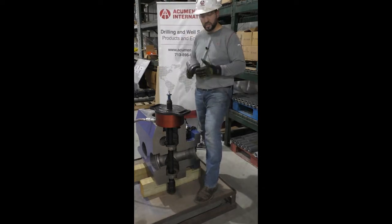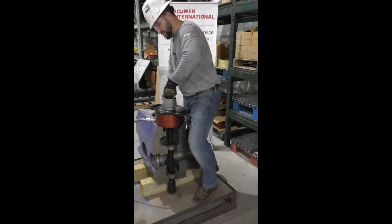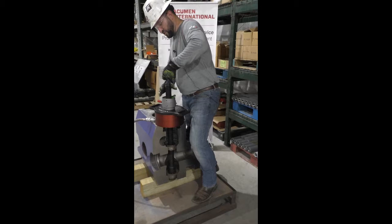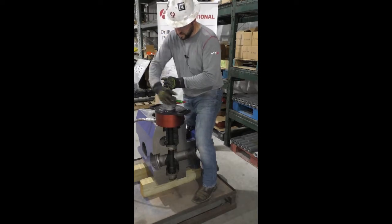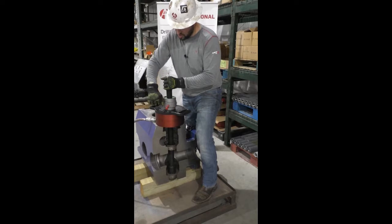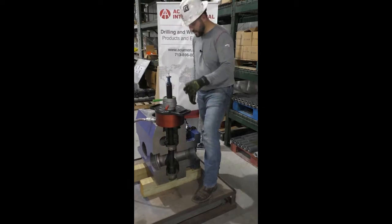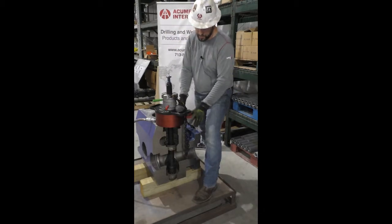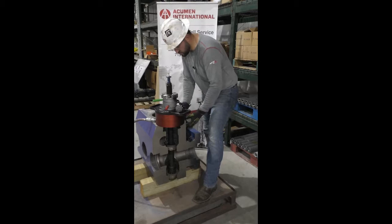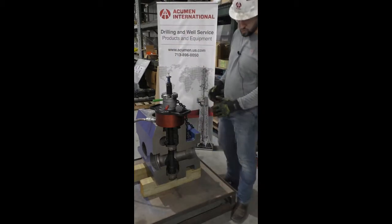A conventional nut works, but again we're going to use our accu-fastener. Just lift up on it, make sure you are grabbing the bottom of the seat, lift up and give it a few turns with the accu-fastener using the green handle only to make it snug. At that point, put your tie-down on, put your chains however you want to do it, and then pressure up.